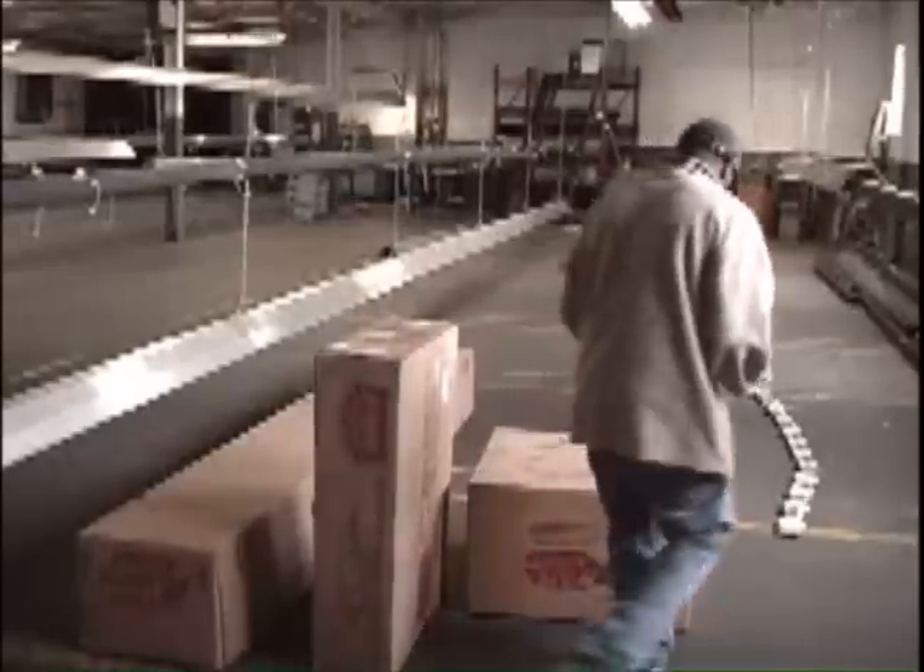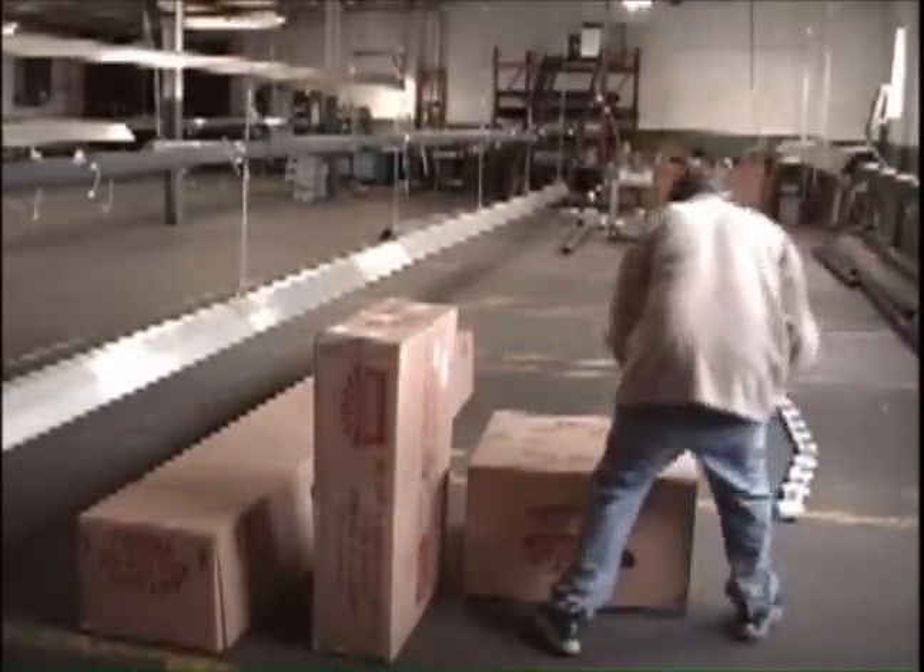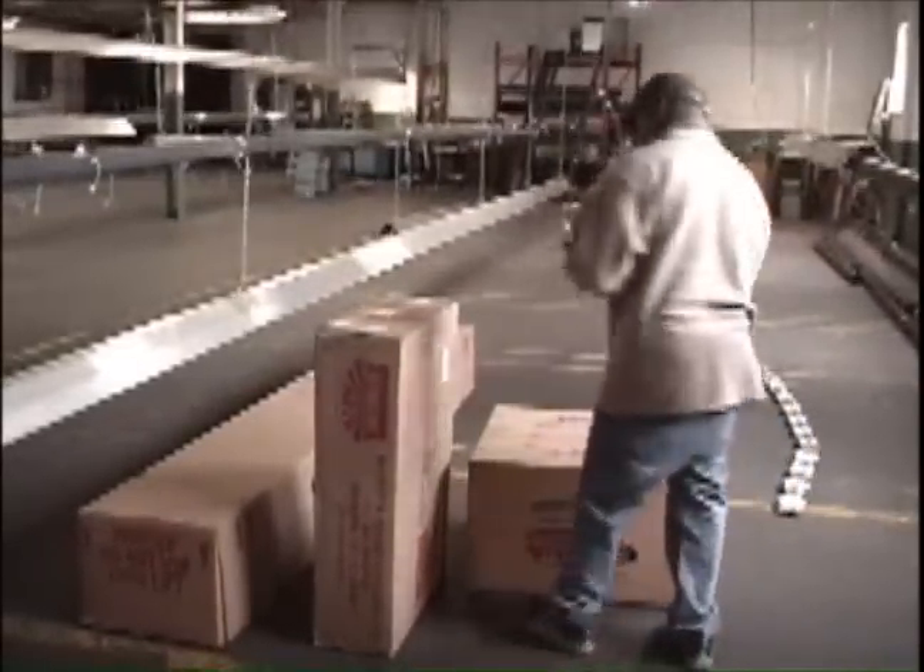To have an efficient installation, the following pre-checks and installation tips should be carried out. Verify all parts have been received by checking them against the packing list. Check the rating label and safety labels on all burner boxes to make sure that all clearance to combustibles will be met.